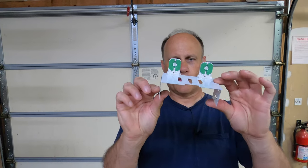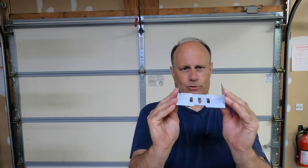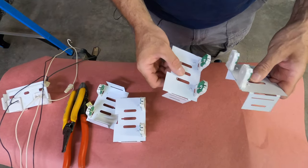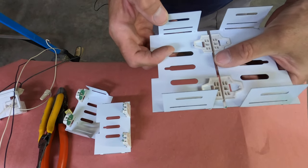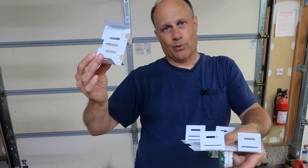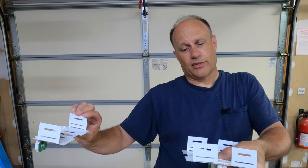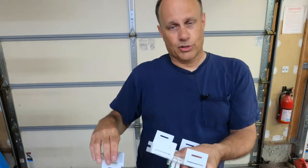We finished bending all the legs over to the width of my U-shape channel. I bend them in a little bit so that with that tension it will hold onto the fixture while I'm working with the drill. In this fixture I went with a single end feed bulb. So in the center of my fixture we're going to be mounting the sockets back to back, and we're going to fasten them to the fixture. Since I went with a single end lamp, 120 volt goes into one side of the socket. The other socket gets no wiring whatsoever — it's a dead socket. All it does is hold the bulb in place. All the wiring gets done right in the middle. And if you remember, my power comes out in the center of the fixture — this is why I chose to do that.